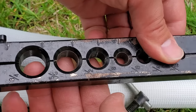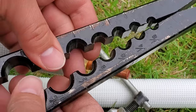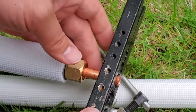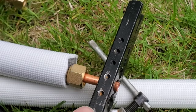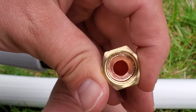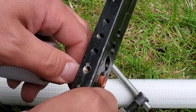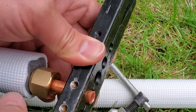We're going to choose our 3/8 inch size and get that set over our pipe. We're going to extend the pipe through about a 16th to an 8th of an inch past the die face — that's the amount of material we want to ultimately flare outward, and you get the feel for it over the years. If you end up with too much out, the cone will be too big and the flare nut won't go over it; too little and it'll be too loose. The instructions for R410A say to extend it out a tiny bit further, so that cone is a little bit larger — right about an 1/8 inch past the face of the die.